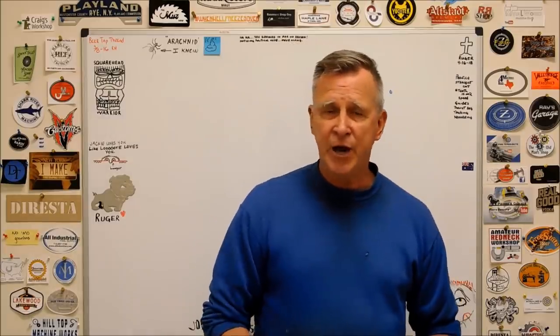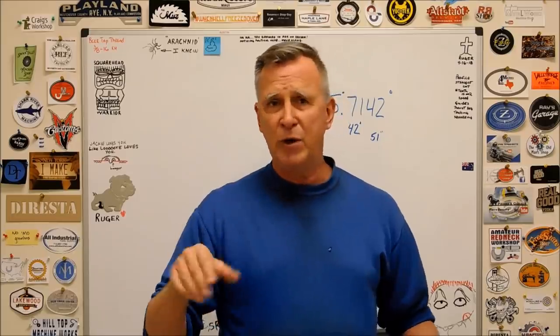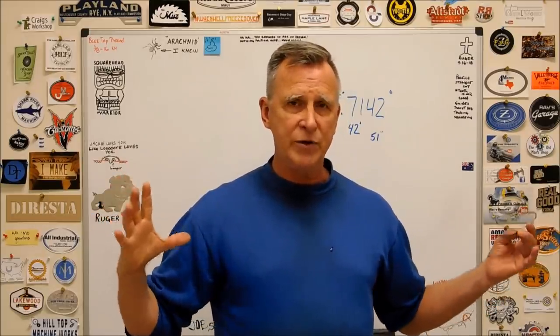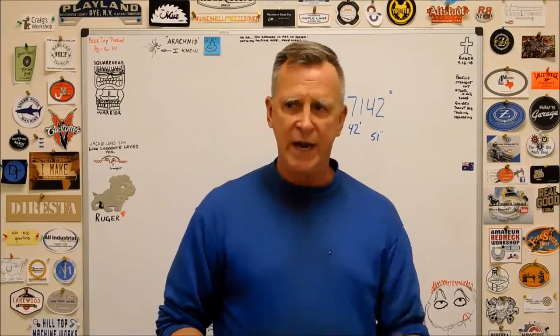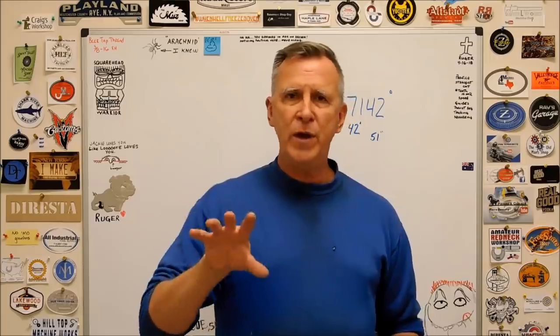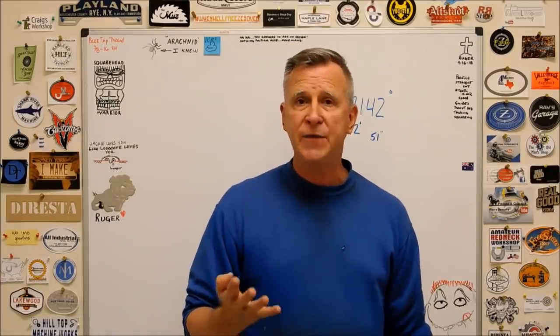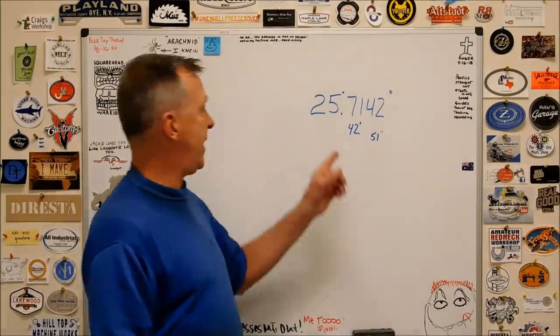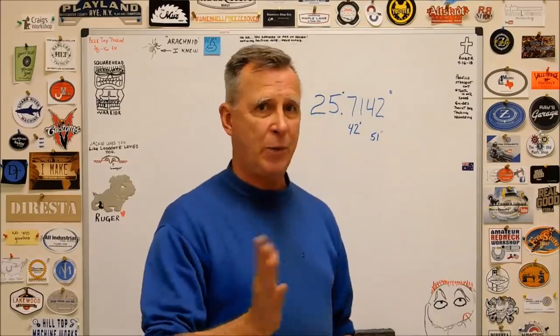Now, if you're following this channel, you know that I'm making a scale cannon. Actually, I'm making two cannons. One is an artillery gun with the large spoke wheels, and the other one is a deck gun that you'll find on a pirate ship. Small, hand size. But the correct spoke wheel on a field artillery gun has 14 spokes. Ta-da! 25.714 degrees between the spokes.